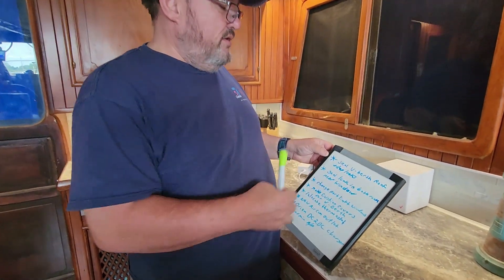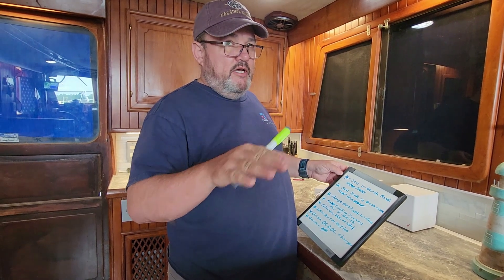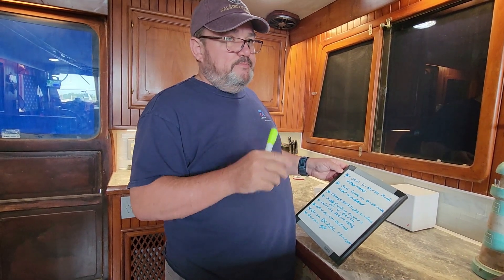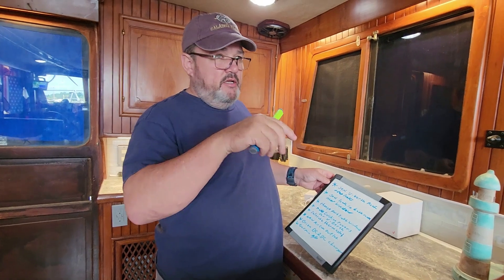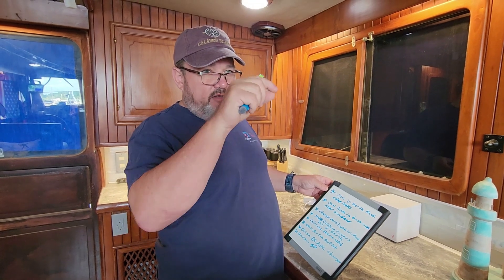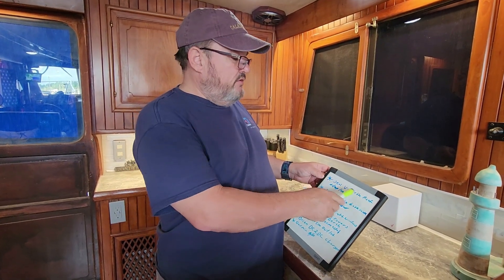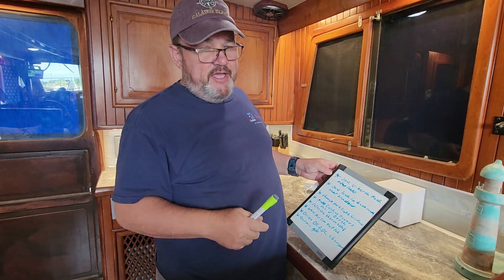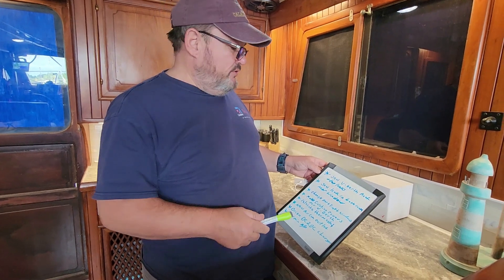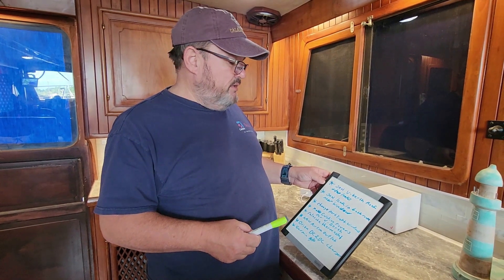In the V-berth on the upper deck, there are a couple of little leaks. There's no coring on the upper deck roof — it's just thick fiberglass. The teak decks have been removed and there are still pinhole leaks, so when it rains hard you'll get a little drips right through the fiberglass. I'm going to seal the V-berth roof with fiberglass, maybe vacuum bag it. Once we paint the deck again it will be leak-proof. That's important for overnights because I've got brand new cushions I'm making that are going to go up there.